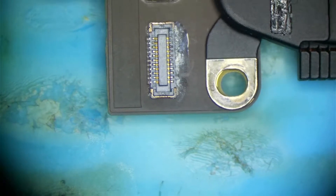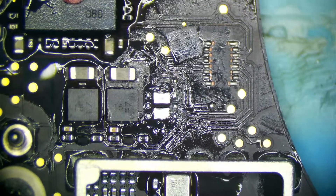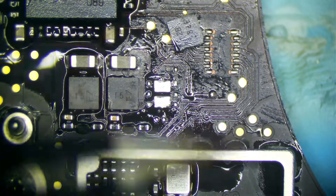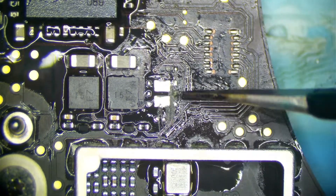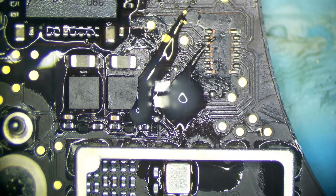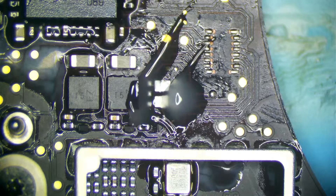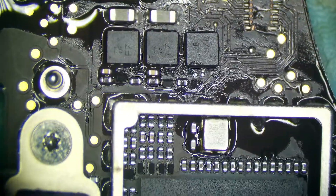There's one of these compatible components on an A1990 board. We've got to take care of that after we're done — that's non-critical for operation. Orientation is 2B towards the top, dot towards the bottom right corner. Let's grab a new one — we also have two resistors to do. Scraping the pads here; that solder looks good enough — with flux it will be fine. Do not want to use too much unnecessary heat in this area because of the underfilled CD3215.